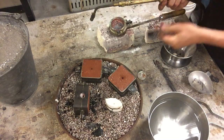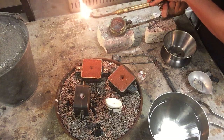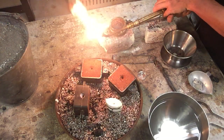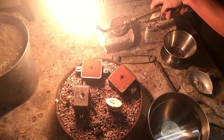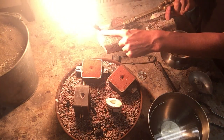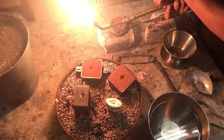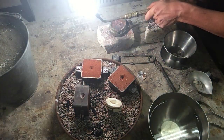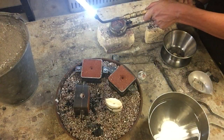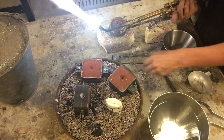First thing we're going to do is crack the fuel line, get a nice light flame, and push that flame so it's bushy but not so far that it jumps off the tip. There's a small gap where the flame is no longer attached to the torch tip — we want to chase it back until it's on, then add oxygen until those cones tighten up to about two or three inches.